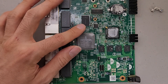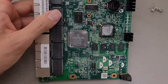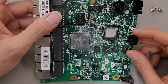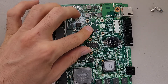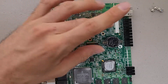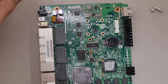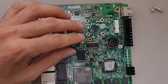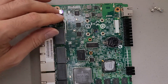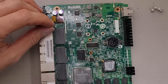We have some memory here, which I believe is probably a memory chip for the network controller chip. There are also spots on the board that were left unpopulated. These do have wireless options, so my guess is this is where a mini-PCI slot would go for a wireless card, along with the screws to hold it down. I don't know if these supported a cellular card or not, but I'm guessing these must have had an option for cellular internet connectivity.